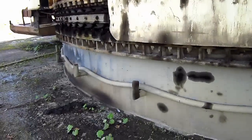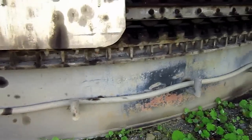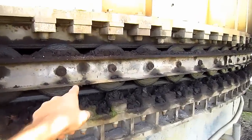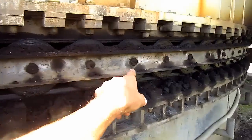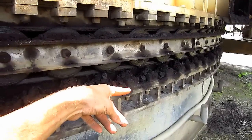From here you can get a good view of the tub on the 7820, which measures 50 feet in diameter. And if you look right here, you can see all of the independent circle rollers, which will swing this drag line about the tub when it's in operation.